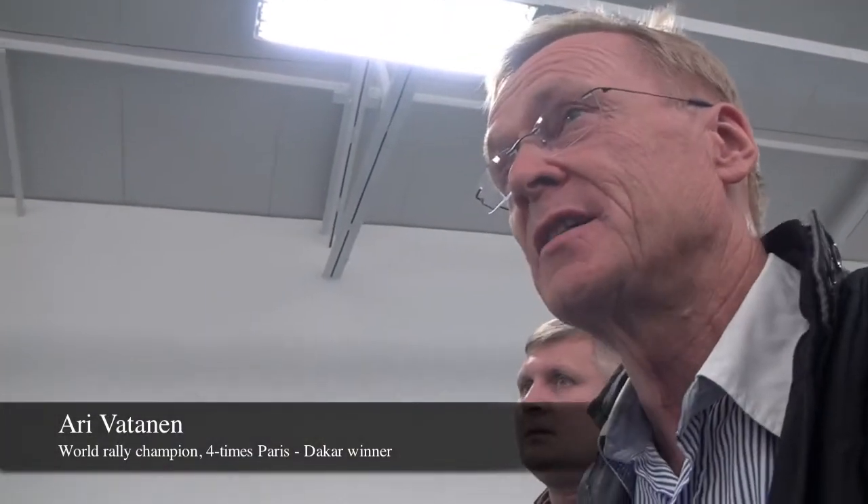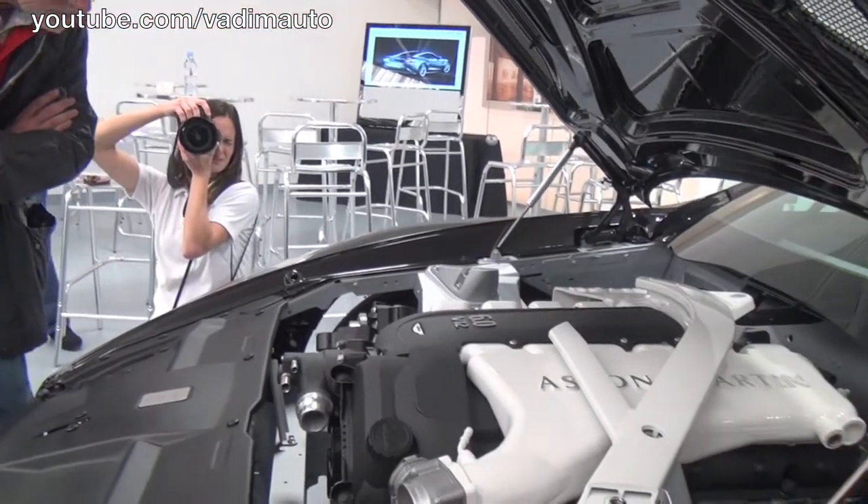How long does it take to develop an engine like that? Normally when you develop a new engine, even with the joint forces of large manufacturers, it takes considerable time. The good news is we've got a great partner. One of the roles of the One-77 — and there's at least one car over there — was to allow both Marek and myself to freely think about engineering and design. We partnered on the engine with Cosworth for our 7.3-liter normally aspirated V12 in the One-77, which we believe is the most powerful normally aspirated road car engine in the world. When we set off on that journey in 2007, we developed technologies — like the variable valve timing, the NOx sensing, and engine management strategies — that fed directly into this engine.